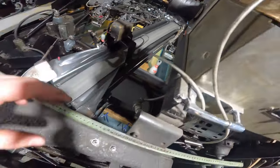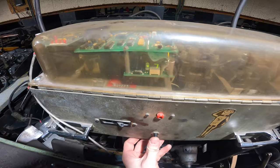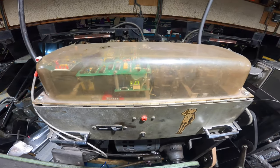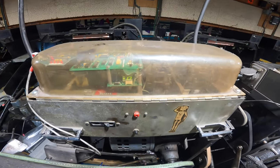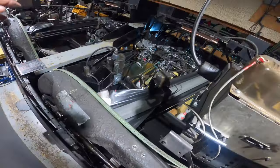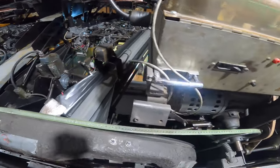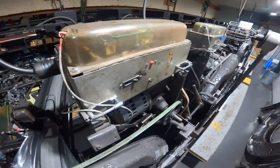You will also want to unplug your back-end motor. When you hold the button down to get it back to zero, the machine thinks the sweep just came up and it's back on first ball, ready to feed pins again. But sometimes that's not always the case — if you have to reset it manually, you may already have all 10 pins in the cups, but the machine thinks it has to feed a whole extra set, resulting in a double feed. That is why we unplug the back-end motor before resetting the chassis back to zero.